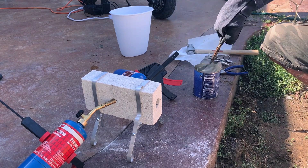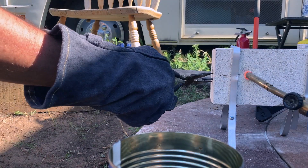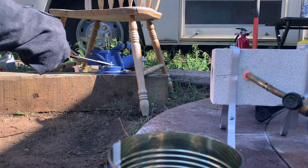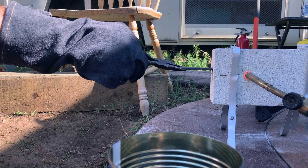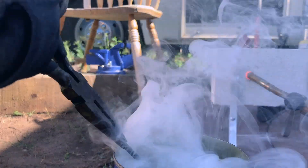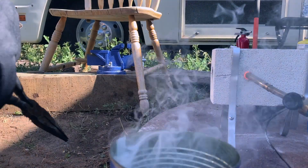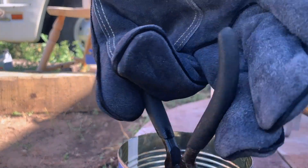After making adjustments for airflow on this forge, I was still not getting quite enough distributed heat. To get a really even temperature, I needed to use the pliers to hold each blade up to the top of that chamber and sway it back and forth, in and out. You can see it's getting up to that good yellow all across there. I have my magnet over on that little blue vice that I kept tapping it on — I'll get into the forging process in another video, but this was getting these blades up to a really nice, even critical temperature.